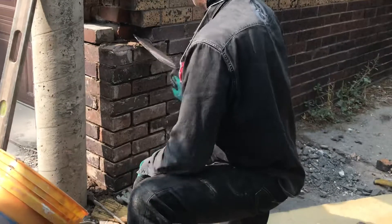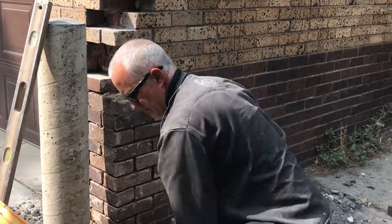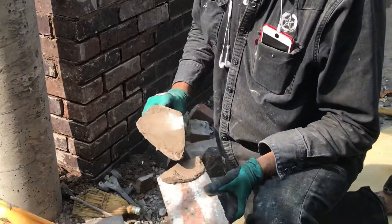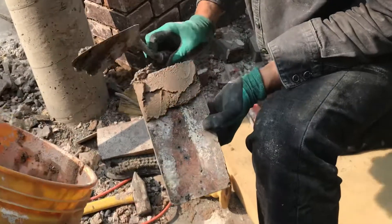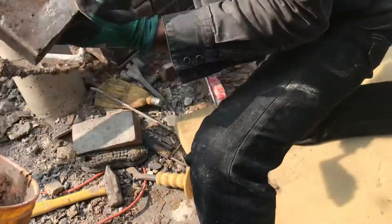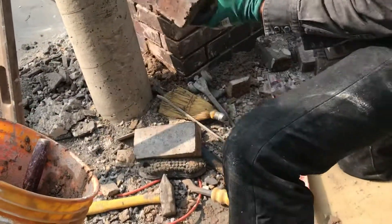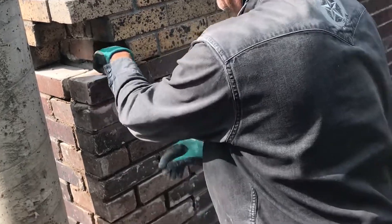You lay your bed joint, get a good brick for the corner — this one's a little darker but has a fairly clean end on it. That's your face and that's your face — figure out which one is your face, then butter up your brick and slot it into place. Butter a little bit there because it's going to lip under, then back butter the back half of the brick. My partner Waylon — my 10-year-old — is shooting video today. Remember to kick it back a little so we don't have to rake it out after putting it in.